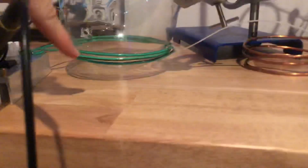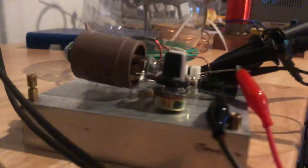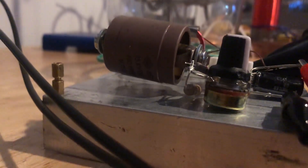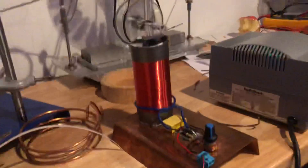All right, here we are. I've tightened the coil to increase inductance and hopefully peak voltages. I've raised the capacitor up slightly — hopefully it doesn't discharge to the heatsink anymore. And we get ionization with the RF oscillator alone and we don't have to use a little slayer. So let's give this a shot.